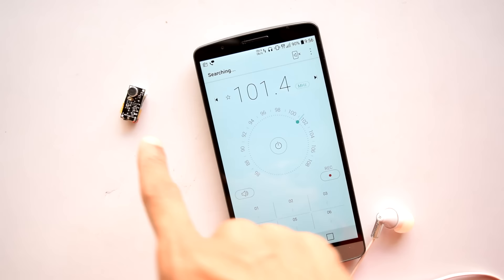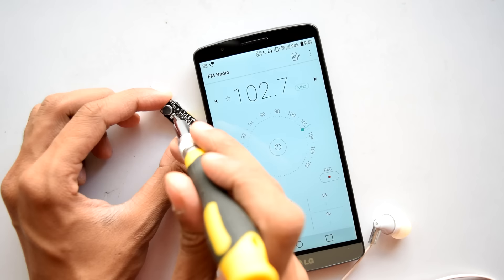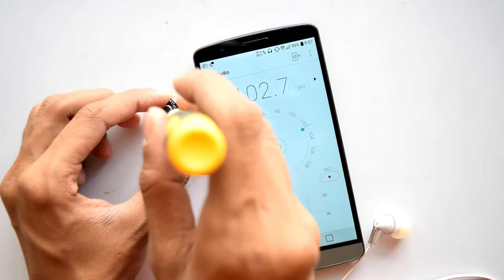Eventually you will find your own voice coming through the FM receiver. If you want to set your FM transmitter to a particular frequency, set that frequency on your FM receiver, then tune the potentiometer on the FM transmitter module accordingly. Let me show you how it sounds.